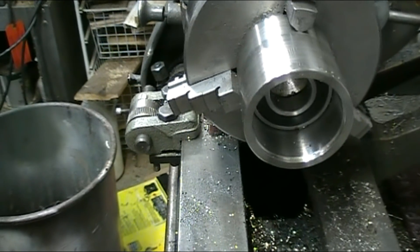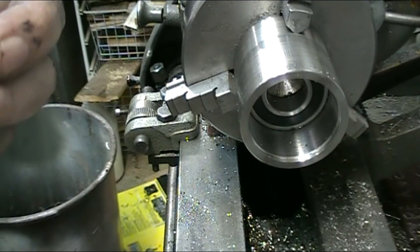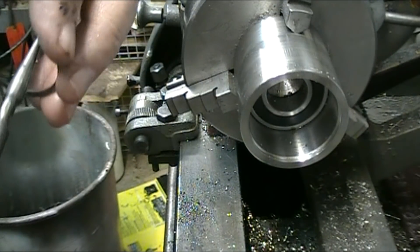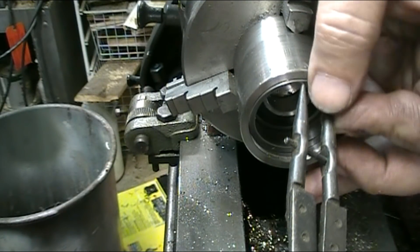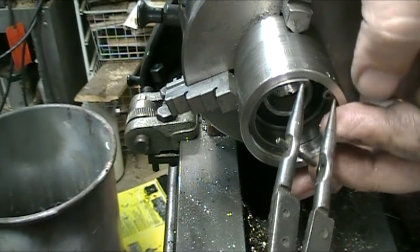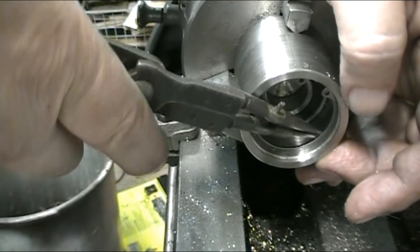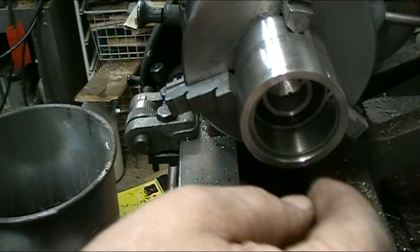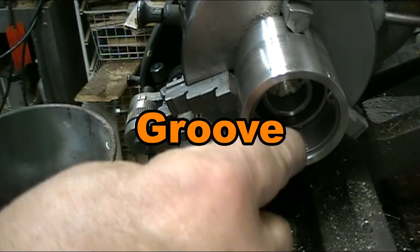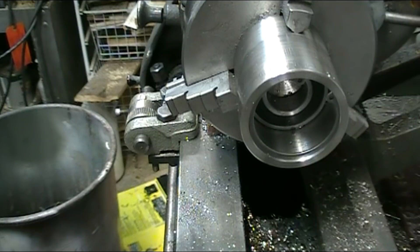This stainless ate that high speed steel bit to death — I tried to resharpen it a couple of times and it absolutely destroyed it. So I ended up using a miniature carbide threading tool to open up the hole and then I was able to square up the edges. The snap ring fits in there pretty good, I can live with that.